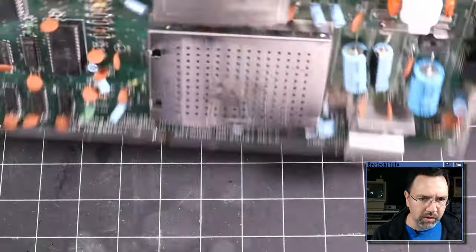But everything else passed, and if you notice down here, we've got the two counters, the 1:22 AM and 1:22 PM. That means the clocks on both of the CIA chips are working and they're in sync. So everything about this Commodore 64 is good. Of course, before we can call this machine fixed, it does need a new CPU. This is my CPU and it won't stay in this machine.